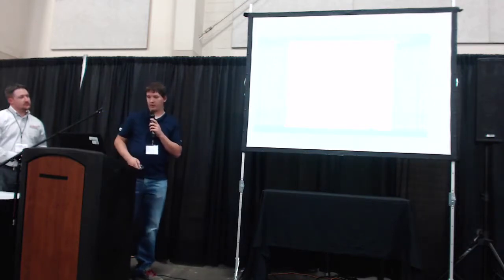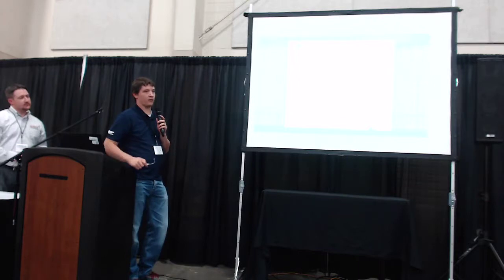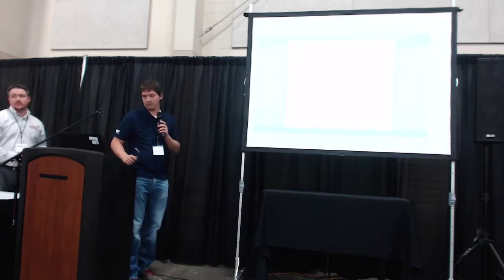Here's another example. This is from an SMA. This is a little bit harder to read on the slide, but you can see that there's the description here. This says 1/2-inch SMA. Same thing, an item number. This one has a production day, the station and offset, 0 to 15 foot left, a temperature and a time. So this goes to show you that just a quick few notes on the ticket can give you a lot of information if there's ever questions later.